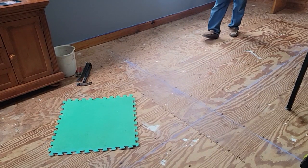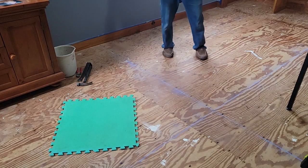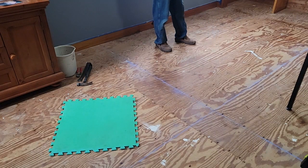The other thing is, if you noticed, when I snapped my line, I pushed the string all the way to the floor, went to the other side, both directions, pulled it really taut. And the string was laying on the floor. That's quite rare on a lot of my projects. A lot of times there's a sag, sometimes 1.5 inches. I think a couple houses, I had like 4 inches over a 20-foot run. And this actually touched in the center, which, like I said, has Weyerhaeuser brand Southern Yellow Pine floor joists. You can see them in the basement.